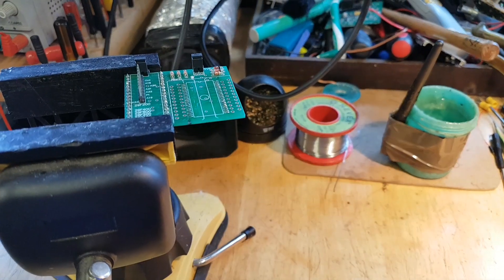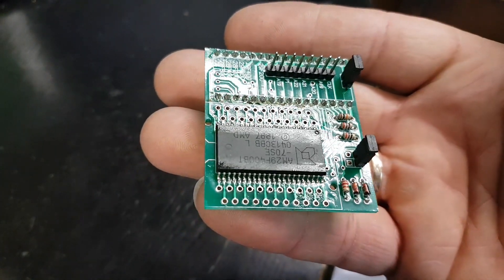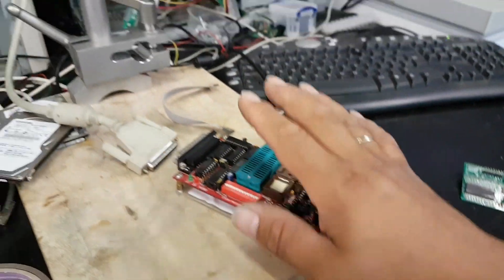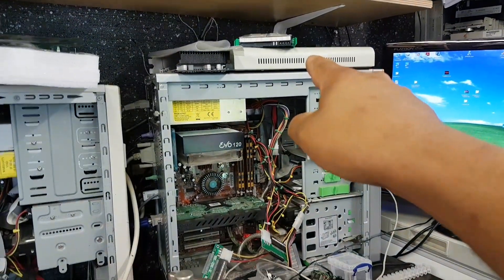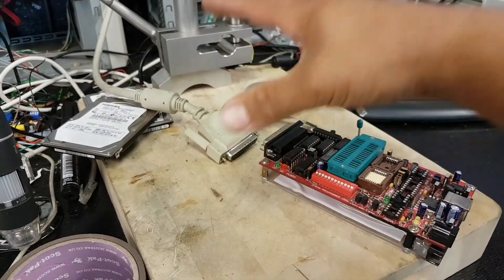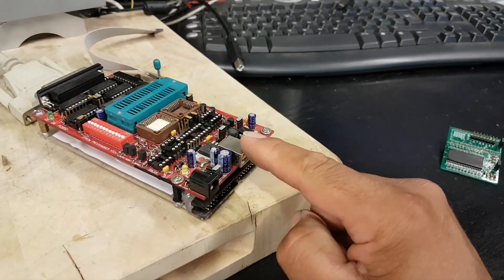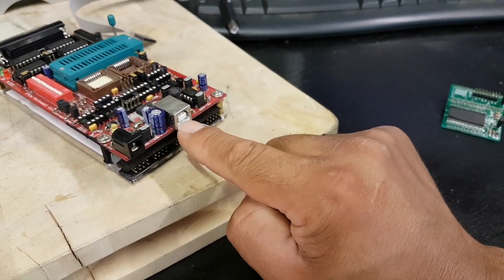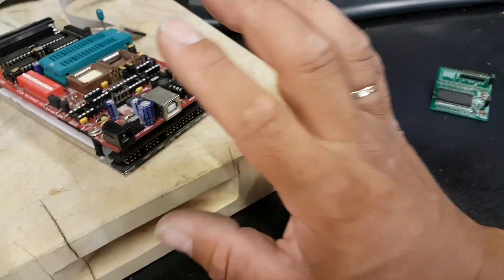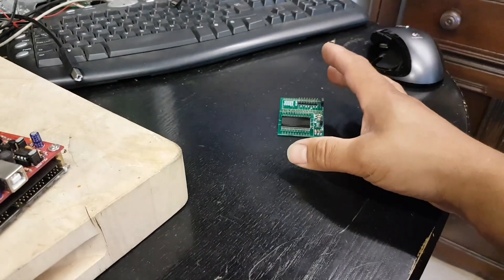What we're going to do now is solder this flash in and then attempt to read it. My chip is already in here. The next step is plugging in the Willem programmer — I'm using the LPT cable from Dataman. A quick note: to flash these chips you're going to need a 12-volt power supply. You can power the Willem programmer with 5 volts through USB, but you need to move a jumper if you want external 12 volts. For this chip we need 12 volts, otherwise USB does not supply enough voltage to program it.